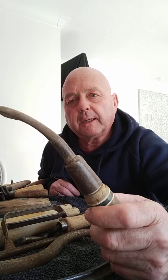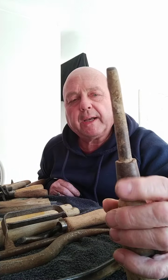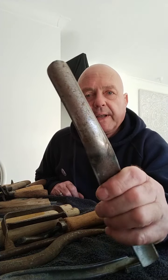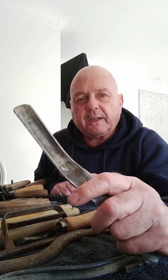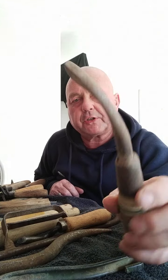That's old. That's just a 10mm bar bent. Obviously, you can see how worn out it is. It's great for internal corners. A lot of people, if you want to do your internal corner and you're trying to get that in there to do it, ain't happening, is it? So most people end up using their finger and just mess the thing up, basically. So that'll get in the corner and give you a nice joint. So just a little bit of 10mm bar, worth keeping in your bucket, bag, tool bag, whatever it is.